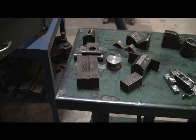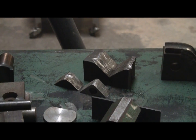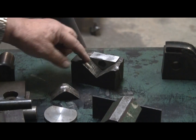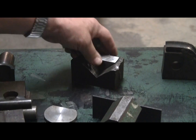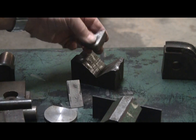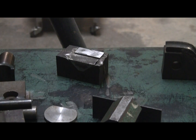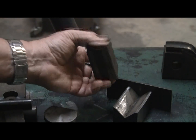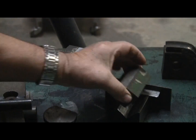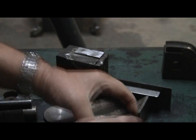This particular tool goes back to when I had a different, smaller hydraulic press and all I had was a bandsaw, so I just literally sawed that out. The pieces that got sawed out then became the punches. That was maybe my first jig of some sort, back in the days when I didn't have much equipment. This is a real early tool — this would date back to the 1960s. Later on it got a little fancier: it's got a lined plate where you can line up your work back against that, then push down on it. It's got two different punches, two different radiuses — a bigger radius and a smaller radius.